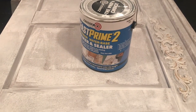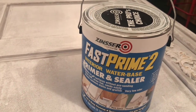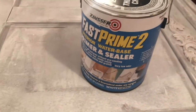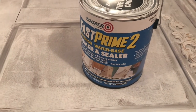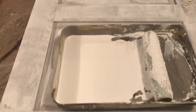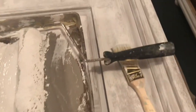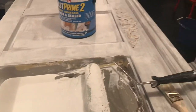I'm going to go ahead and start the second or third coat — I've lost track. This is the primer I use. It's not oil-based, it's water-based. I just seem to have better luck with it — the oil base is hard to clean up and takes forever to dry. This is just as good. I do a couple coats usually on projects that need to be a solid white or covering up a solid color that's hard to cover. I always use a primer. When you're doing a big piece of furniture, go ahead and roll it — there's no need going at it with a little paintbrush. I roll the first couple of coats, then go back with a trim brush and fill in all the little corners and details. So we're priming — we're getting there.